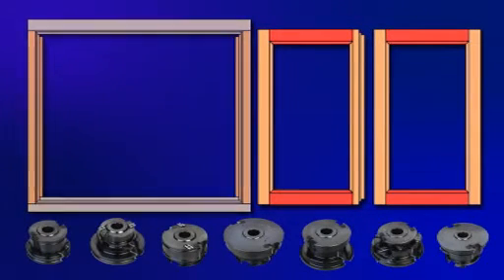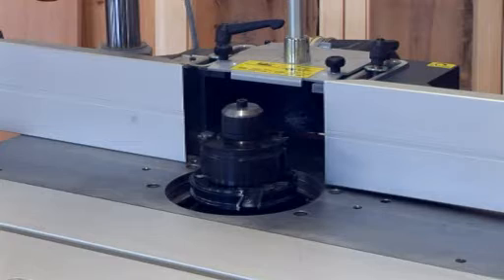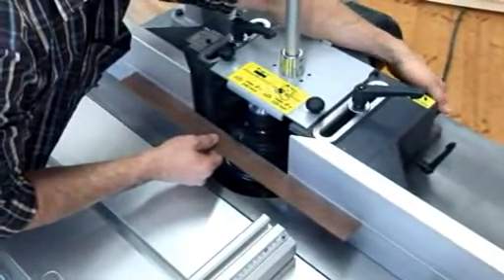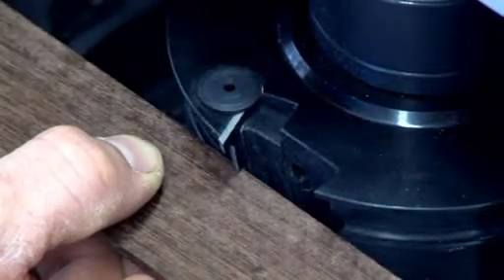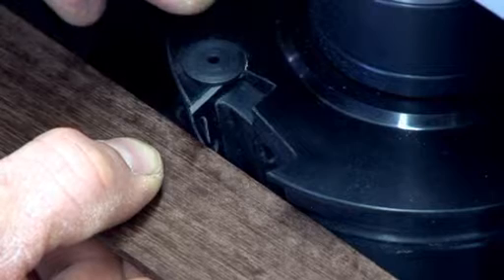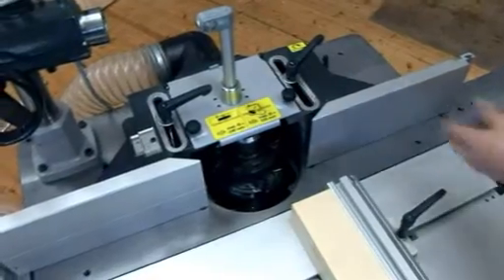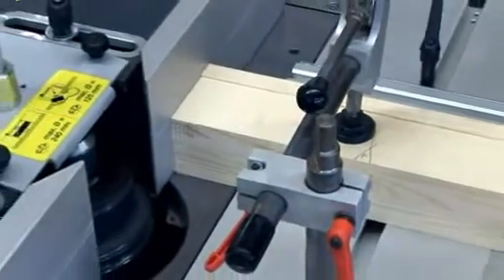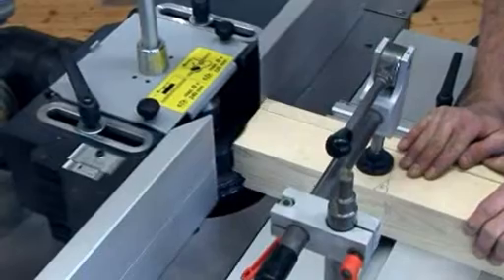The first step is the profiling of the windows. Place the combination tool in the machine and select the appropriate spindle speed. Then set the depth of the tooling by using a thin piece of wood, whereby the deepest part of the tool sits against the wood. Set up the required height of the tool — this setting will be kept the same for all of the working processes. The tenoning table on the Felder spindle moulder helps give a perfect result when profiling, and the eccentric clamp ensures that the workpiece stays fixed to the table.